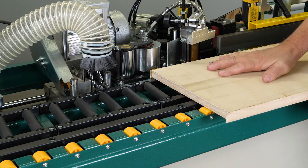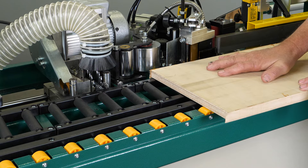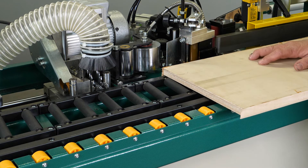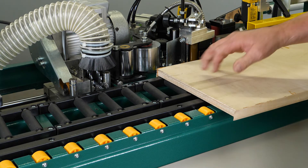On our material piece here, our edge banding tape has exceeded the end of the board, and as you read in your book, your solution would be to make an adjustment for your limit switch, adjusting it towards the infeed side of the machine.